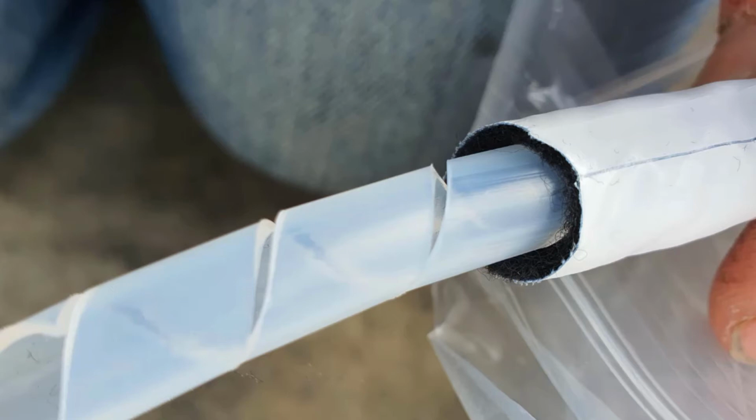It's a membrane infusion hose. As you can see, it's a spiral wrap which is normally used for the resin infusion line. Here it's used to create our vacuum. You can see the white around, that is actually the membrane. The idea of this membrane is it allows air to permeate through, but it doesn't allow any resin. In theory, you could get rid of the catch pot, but I like to have it just to be on the safe side.